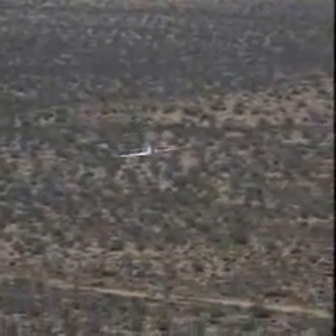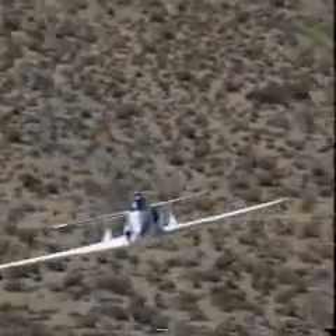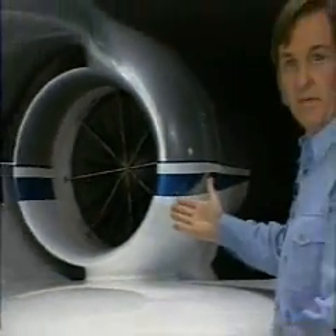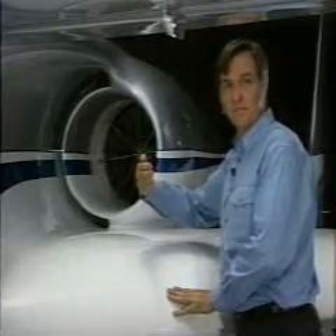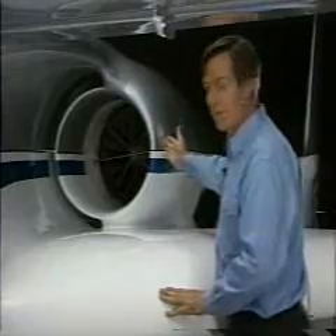The Ares, a unique aircraft designed to combine the capabilities of a large cannon and a light load airframe. Engine inlet gun gas ingestion problems were solved by mounting the engine inlet and the gun on opposite sides of the fuselage. In order to accommodate the inlet in this unusual position on the aircraft, the engine is mounted nose left so that the airflow coming around the fuselage goes straight into the engine inlet.